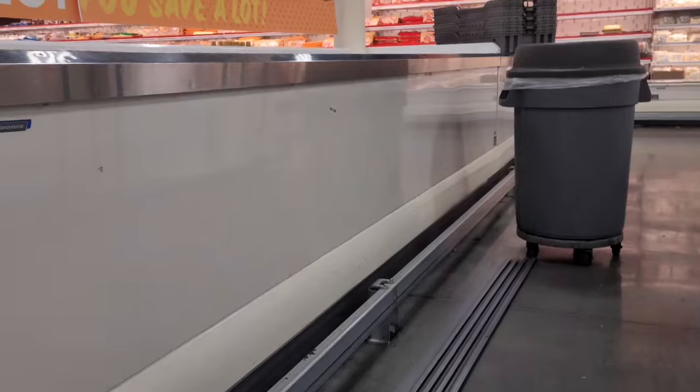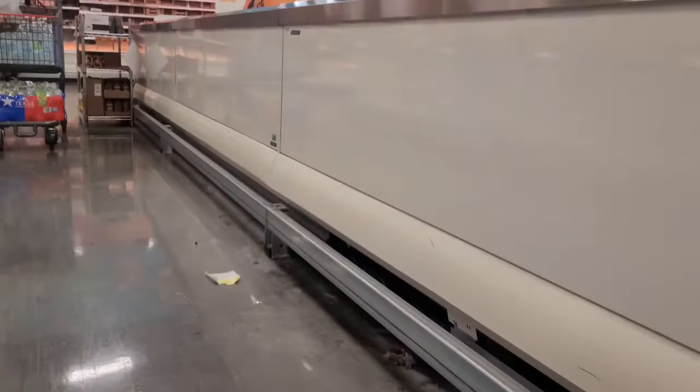I like that. And so these two, this is D and C, the middle one, they drain here under the case. It's a floor drain. And case B is going to have a drain over there. So just making sure, because I'm going to be running a lot of water here, that my drains work and that these drains are actually just plugged instead of something else being plugged down here. So now I feel good about that, because y'all can see there's no other blockages. It could only be in these pipes, or at least for these two. I think this one's going to be the same.